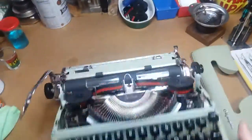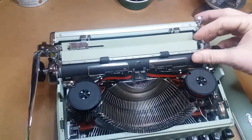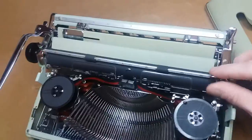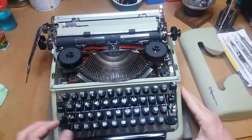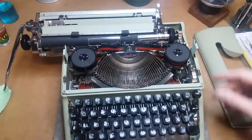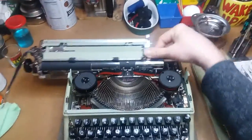We replaced the body bushings, yanked the platen out and sent it off to JJ Short. While that was going on, yanked the feed rollers out and did a full reconditioning on them — didn't replace them but did recondition them, because they were all slick and dried and hard on the outside. I've never seen Olympia feed rollers do this before, but they had this weird kind of bubbly stuff on them and I ended up having to scrape them with a dental tool and then chemically treat them multiple times, but they eventually softened up really nicely and now they're all super grippy.